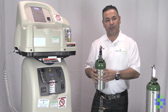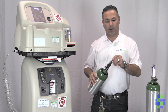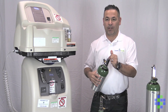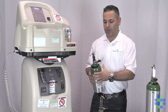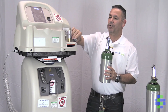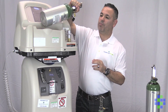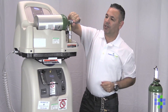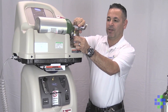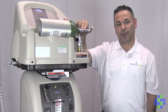When filling on the compressor, the first thing you want to do is make sure your tank is closed. You have a toggle valve at the top — you close it by turning clockwise. Once it's nice and tight, go ahead and remove the black cap, and then remove the gray cap on top of the compressor. You want to line up the port on the tank with the port on the compressor, and snap it down. You should be able to hear that snap. Now you're ready to begin filling.